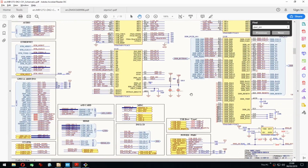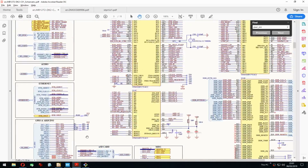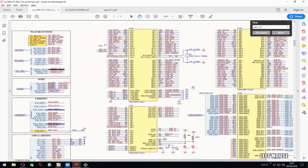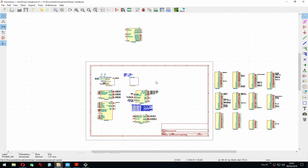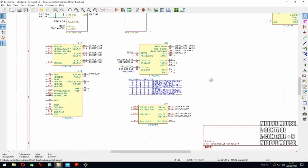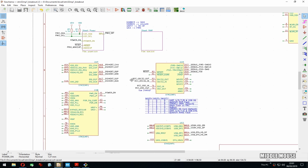While we're here, now the power pins are not here, so let's check. Oh, they have a 1.5 pull-ups only. Wow, that's really low. I think 4.7 should do. I have a lot, like I have a reel of 4.7s. That's what I want to use. I think 4.7s would be cheaper than 1.5 because they are more popular. Yeah, we're starting to get somewhere, I believe. It's that one. Yeah, I think that's gonna be enough.